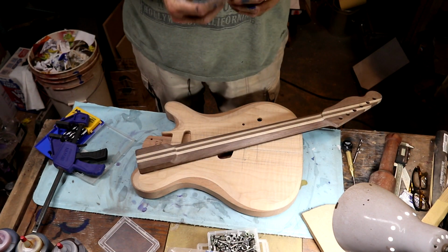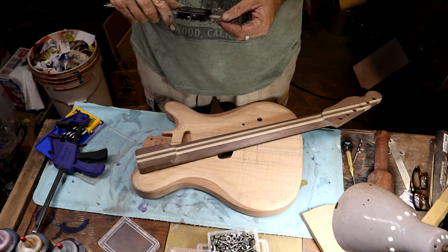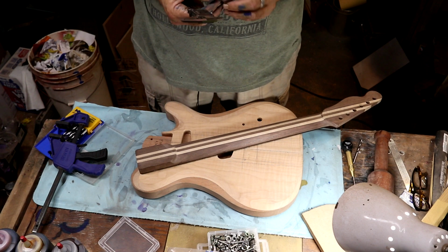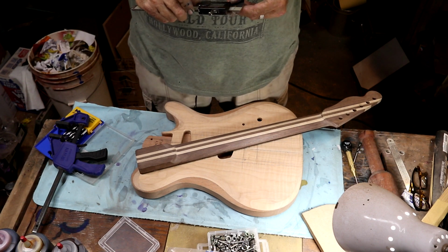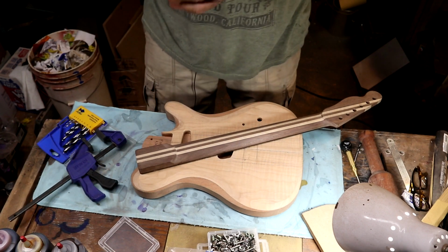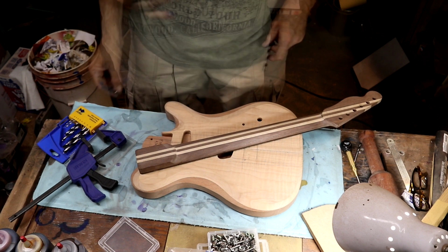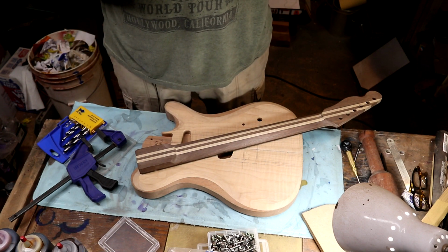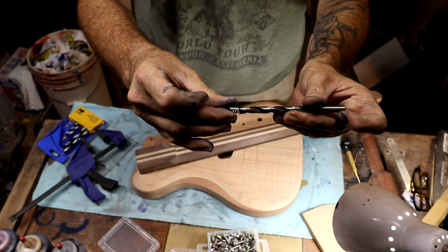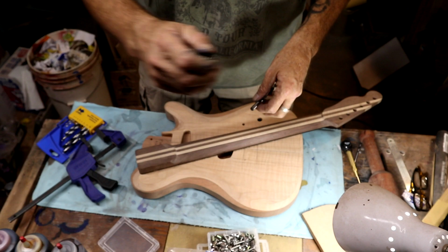These are carbon steel. Let's find out the diameter of this thing. Inside the threads, 5.76, and at the widest point, 9.42. I am going to use an 8mm. You don't want them so tight that they start breaking wood apart. That gives me enough of a space to get that first taper down inside the hole, and then these can bite into the wood once they're inside there.